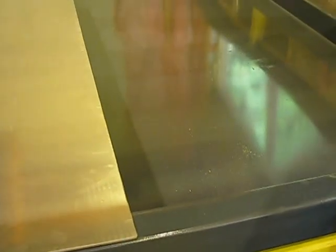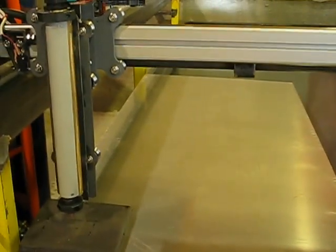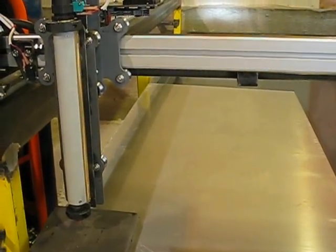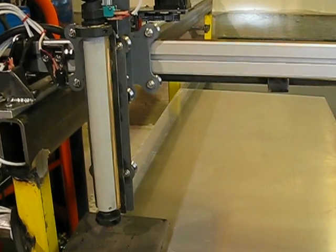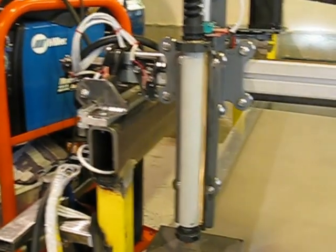You can just see through the reflection there the image where it was rubbing. All I need to do is plumb a drain into the water table and get my slats in there — temporary slats — and I'll use the table to cut the real slat supports so I can get the table loaded up with slats and water. And it should be a running unit. So there we go, everything is just working 100%.